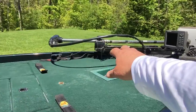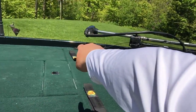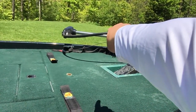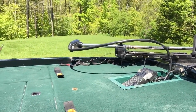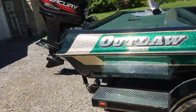As far as the trolling motor goes, I've lubed up all the pivot points. One thing I look out for is this rope with the T-handle on it, which is the release and pull-up. It frays underneath this junction right here, so you've got to make sure there's no fraying or it could snap on you. If there is fraying, go ahead and change it so you don't have any problems when you're fishing.